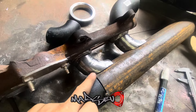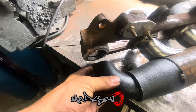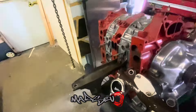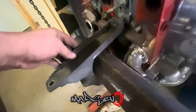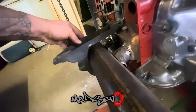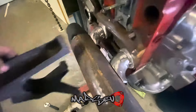This is what I had in mind — this has just got some slight curve in it so hopefully the exhaust wants to direct that way. This last one here is just going to be a pipe there — I'll fill this little gap up there so it should work. This does look excessive but it should be all right. First hurdle — she doesn't fit. Yeah it's quite a big gap there, so I'm going to have to suck that in — that's a good 20 mil, might have to go even more because I just don't want it hard against the engine bracket.